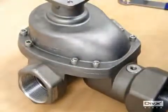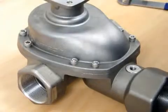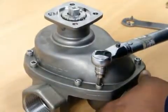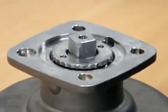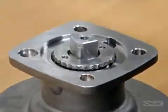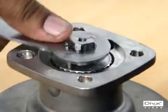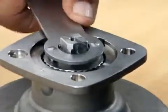After inserting all the bolts in the bonnet, I then use a torque wrench with the appropriate setting to torque it down. Once the bolts are all torqued down, I then tighten down my gland nut using a gland nut spanner. I'll turn this gland nut right down to the bottom, as tight as possible.